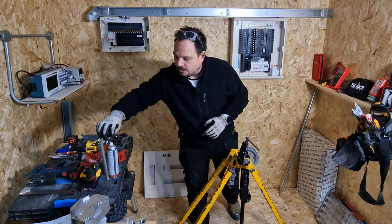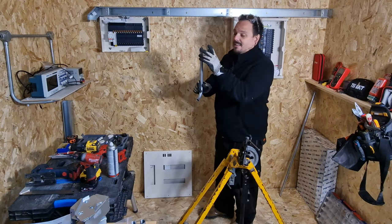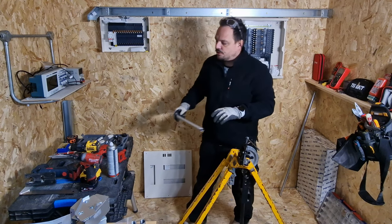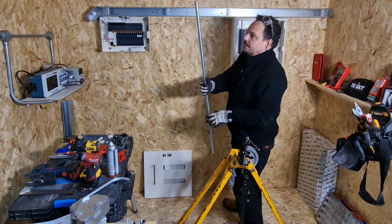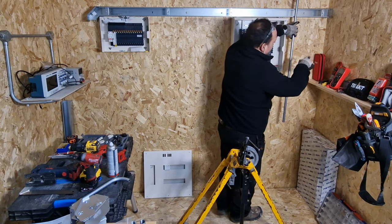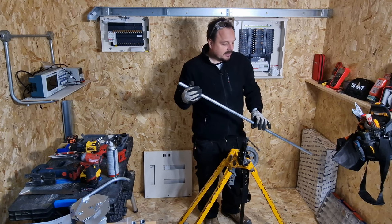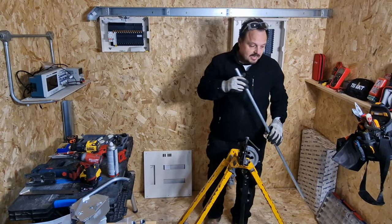First up I've got a little off-cut here already from another job, so we're going to make use of this. It's a good length, it just needs making into a straight piece and we've already got a threaded end. That's going to live somewhere over here and we're just going to drop a socket outlet onto the end of that. So that's a fairly straightforward one - we need to cut this one off flush. We're going to add a second socket and with this one we're going to take a bend on it. I've got a longer length here and we're going to install this at this side, swinging a little bend across to put it near the edge. We're trying to demonstrate some of the skills you might use in measuring, marking up, and how to actually use the threading tool, for those of you who haven't done it before.